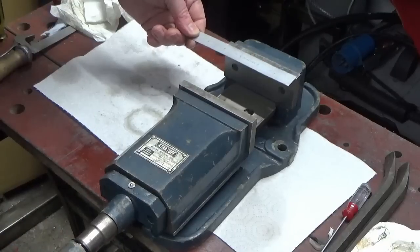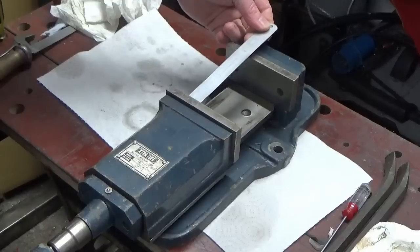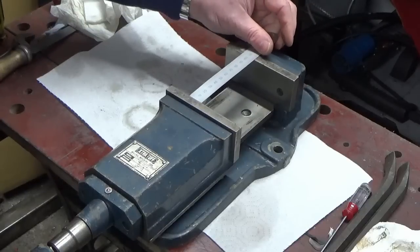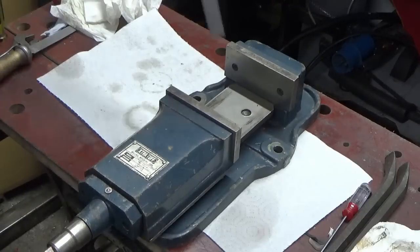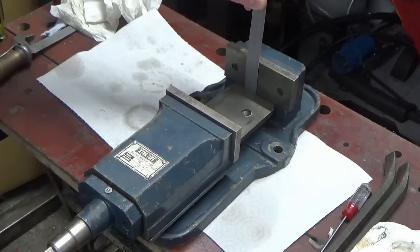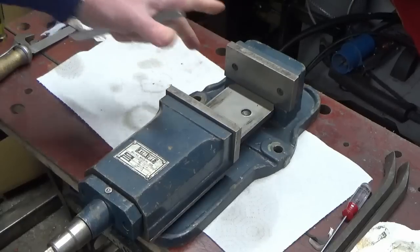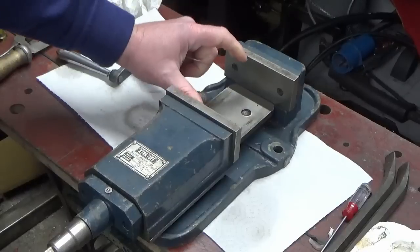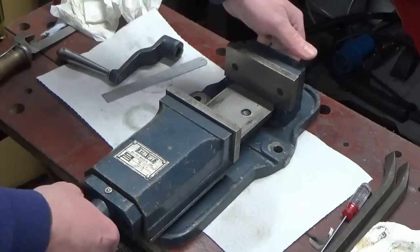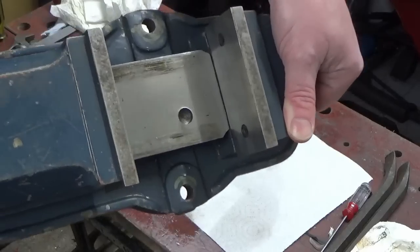So as I said, it's a 4-inch opening, so 100mm width, and opening wise it's just over 4 1/8, which is 105mm pretty much that way, and then gripping, so of that 85mm depth of the entire vise, 45mm of that is gripping depth, which is really what attracted me to this. There's a lot of gripping space for the overall height of this for the profile, so very good in that respect. We've got one idiot mark in the base of the vise, and only one.